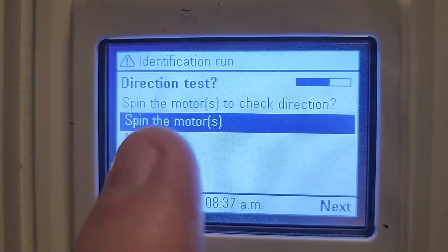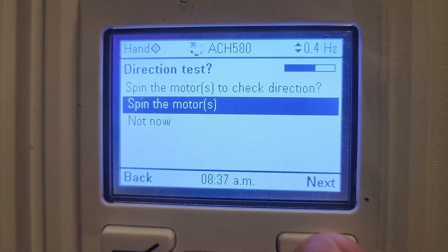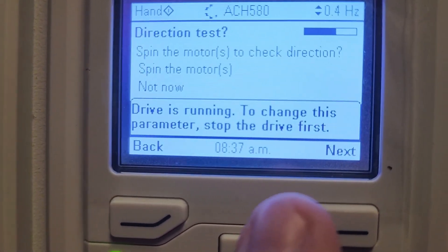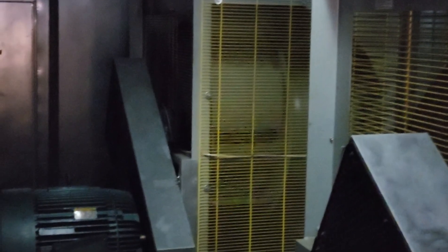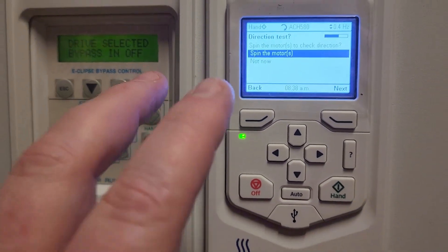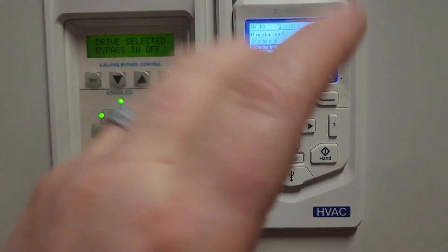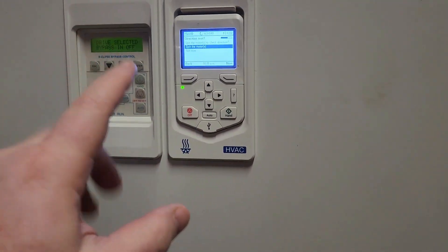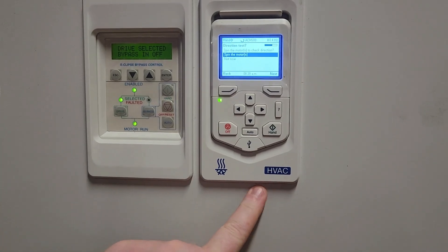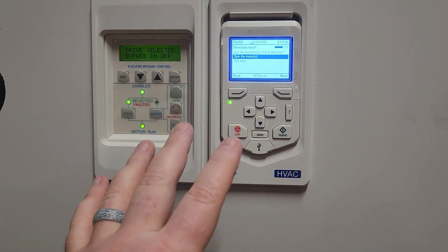It's giving us an identification that it should start rotating. I'm going to hit next — the drive is running, so let's go check our motor. We can see our motor is running in the proper direction, as shown by the indication on the arrows. Now that we know we are going in the right direction, one thing you need to be aware of: if you have a drive that does have a bypass, you do not need to reverse the direction on the VFD. These come from the factory phased properly, so if you change the direction in the drive and you ever go over to run the bypass, the motor will go in the opposite direction. If you do have to reverse direction, make sure to change one of the leads on your motor.